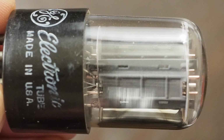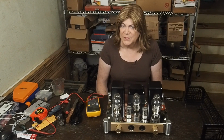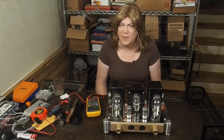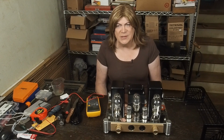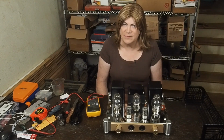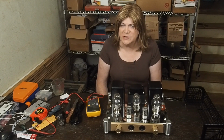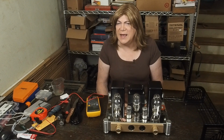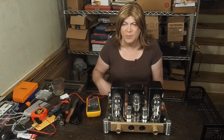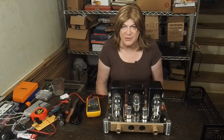Of all the tubes that I swapped into this amp, these sounded the best. These, just from experience, I know have a little extra bass, and the upper end's a little toned down, even compared to some of the Sylvania tall bottles and the Russian 6H8Cs. So, given how this amp seems to be tuned, at least listening on my Klipsch RP600M speakers, I think that these little short bottle side getter tubes are a huge improvement to the way this amp sounds.